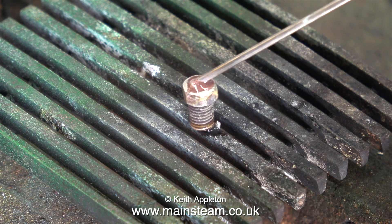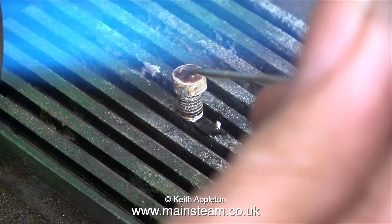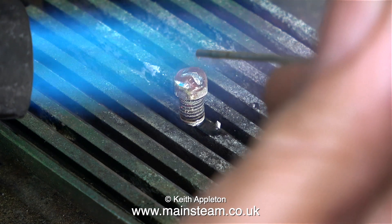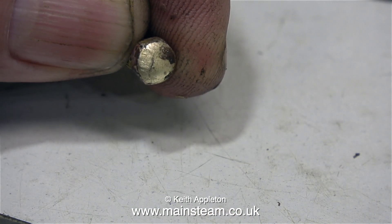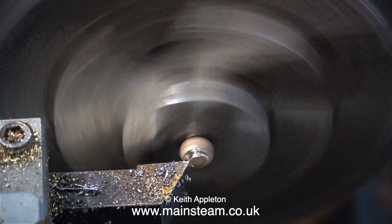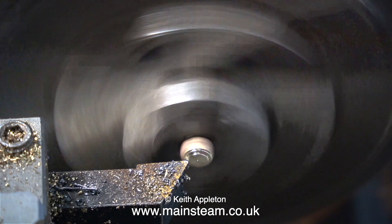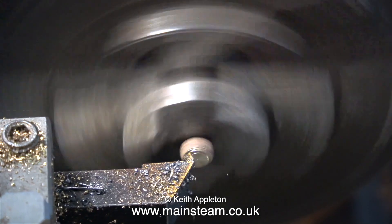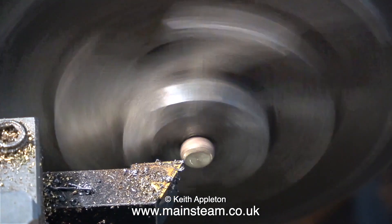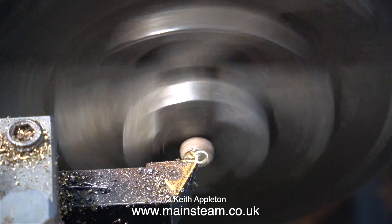You may be wondering why this part is not sticking to the stainless steel grate and being silver soldered to it. The answer is simple: because it's very dirty. As a good tip, whenever you silver solder anything, make sure that all the parts are very clean. The part fell over a couple of times, but in the end it looked like this. Here it is lightly held by the threads in the lathe chuck, and I'm machining away the excess silver solder. This turns fairly much like brass, but instead of coming off in small chips it comes off in long lengths. I'm taking fine cuts because I don't want the part to jump out of the chuck, as I've already mentioned it's just held by the threads.